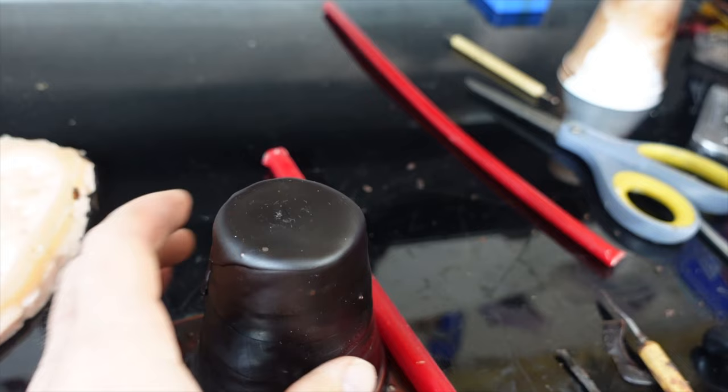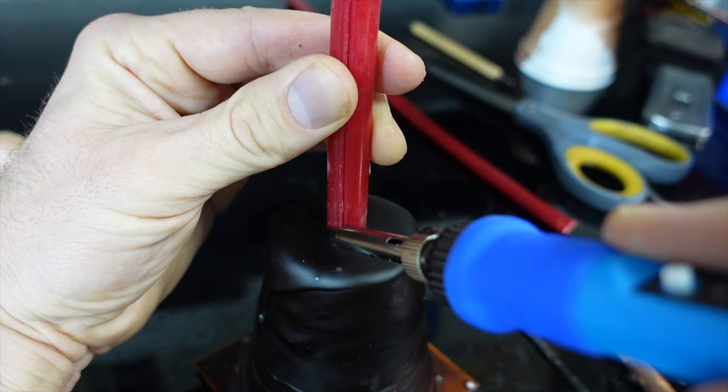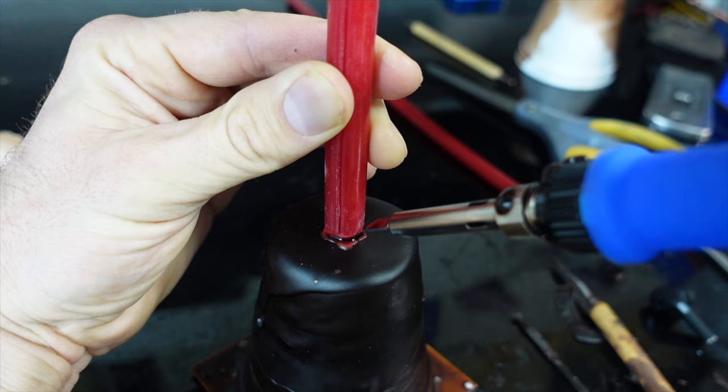To make the sprue tree, I attach a long sprue to the pouring cup. It takes a while for the molten wax to set up, so I usually take some canned air and spray it on — that freezes everything instantly. Sometimes that's tricky, so I ask my wife for some help.